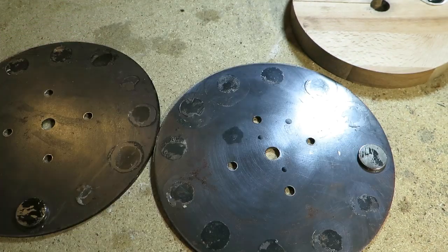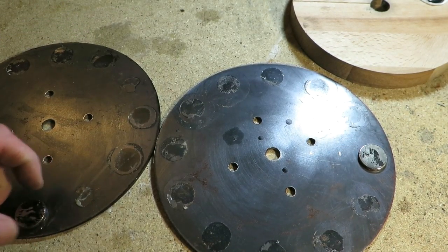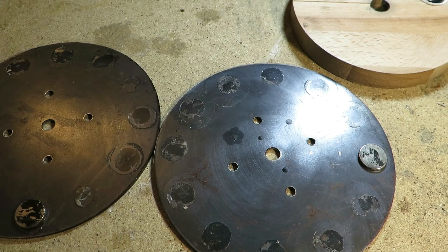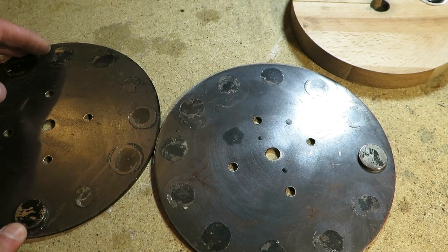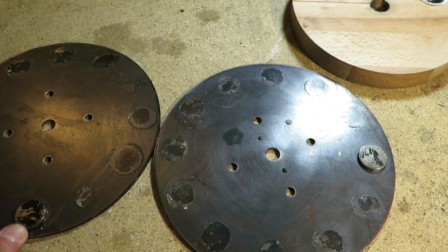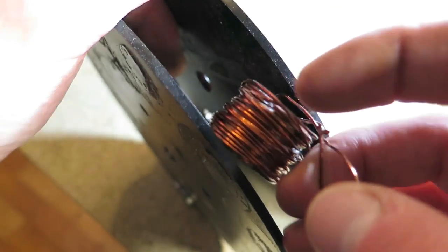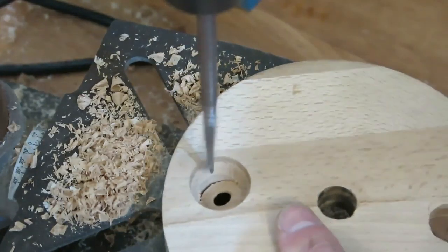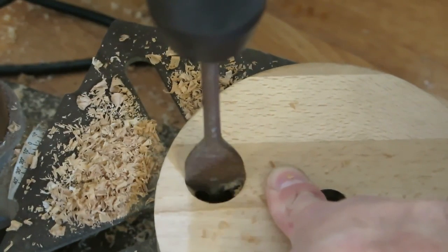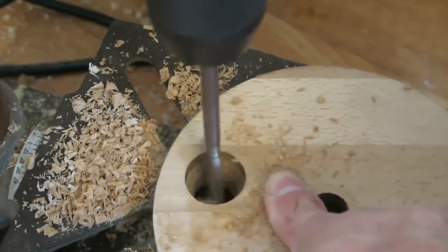And I'm using fans because they are cheaper than Hall sensors themselves, and I can get them at any time locally. These two discs are from motor mounted on bike. They were mounted on some spacer with magnets facing inside and there was a coil array. Every second coil was wired in parallel. I'm going to reproduce this motor function with extremely simplified construction.